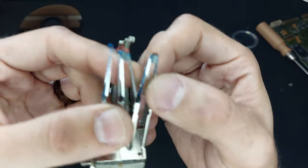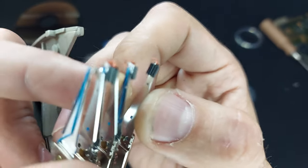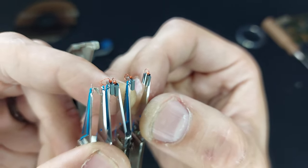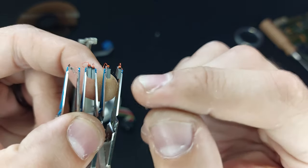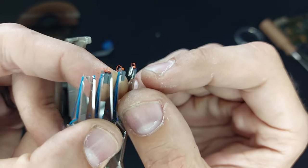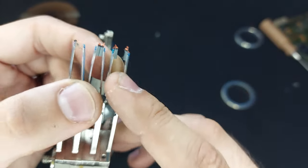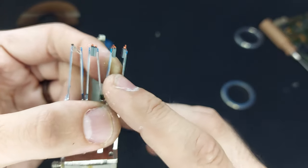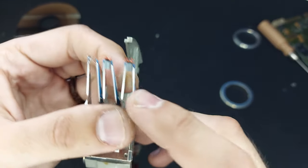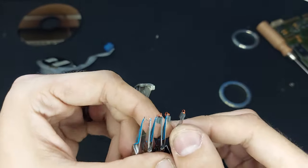And we can look closer at the read-write heads themselves. You can see there's some very finely lapped ferrite, and there's basically one turn or more turns of a coil ending here. So this is a small coil, making a magnetic field concentrated in as small a region as possible. The modern ones have the magnetics and the tips of the heads so small they're microscopic, and they're so finely lapped because they actually levitate over the surface of the platter.